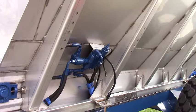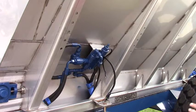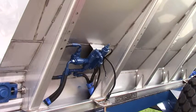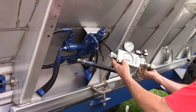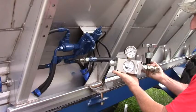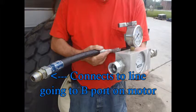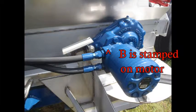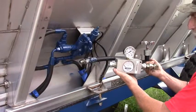We didn't check everything from the hydraulics up front on your tractor or truck. Now we're getting to a point where the conveyor still won't come on. There's one thing that each farmer may need to invest in — a flow meter. You can come off the control flow and hook to the inside of the flow meter. It's got in and out ports, gallons per minute, and PSI readings. Once you connect it, take the control flow hose off, connect it, and it goes to the B port at the back. Turn it on. If you've got gallons per minute coming out, that means hydraulic oil is going through the PWM.